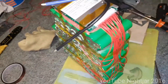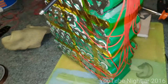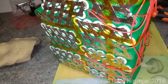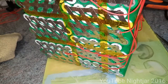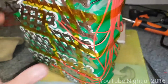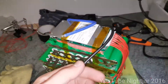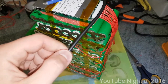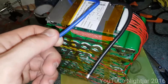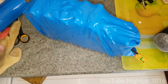I've got all the fiddly little wires done as best as I can. I've used this Kapton tape — it's a heat resistant type tape you see in a lot of these battery builds — just to try and organise it a little bit. But the whole thing's getting shrink wrapped anyway so that'll hold it all in. This just goes to battery negative — the most negative point — and this goes to either the charger or whatever it is that you're trying to power, so the motor.